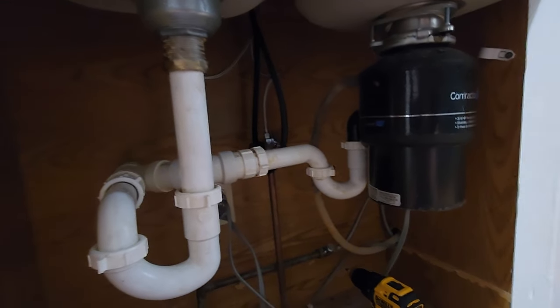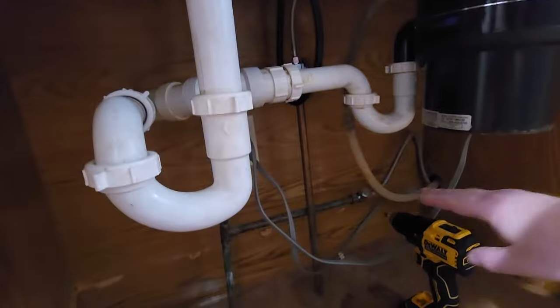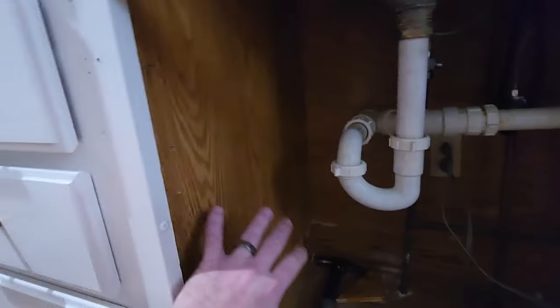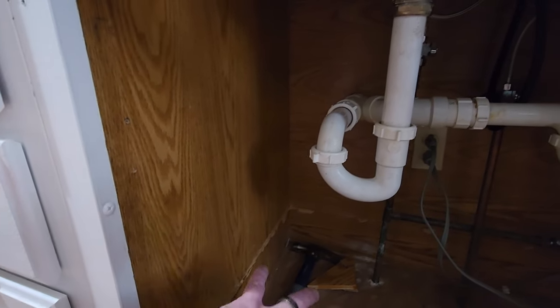So as I'm strategizing here, those are things I'm thinking about. Where's the dishwasher draining in? Where's the line for the dishwasher that goes in? And then also my framing, how am I going to fit that in? So for farmhouse sinks, if you don't know already, your framing has to at least support it.